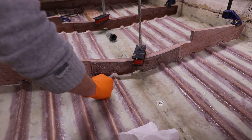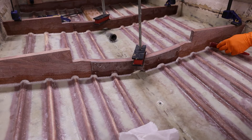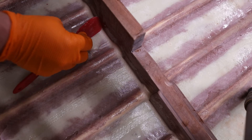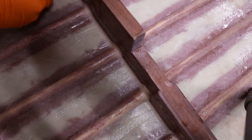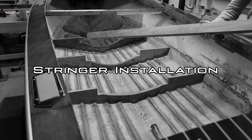Once those are put in place, I run over them with the spatula filleting tool. What's really great about this tool for this application is that because it's really flexible, it works well on an uneven surface — where we've got undulations in the glass it rides up and over those really nicely. I'm also retooling fillets here: once the epoxy starts to set up, you can go back over a fillet, re-smooth it, correct any slight slump, and get a much nicer finish. It's a little bit dependent on timing, but if I'm still around the job as the epoxy starts to set, I'll often go back and retool for a better finish.